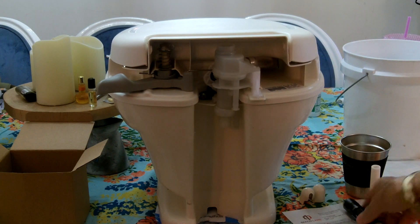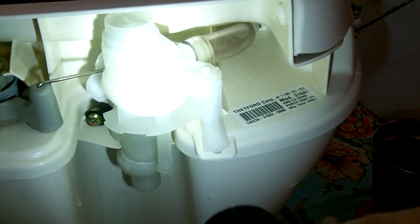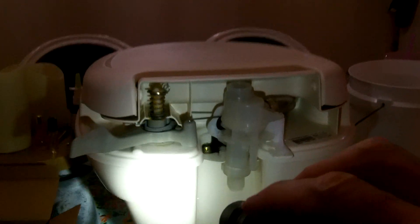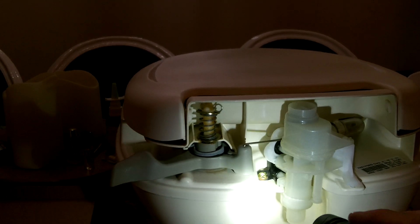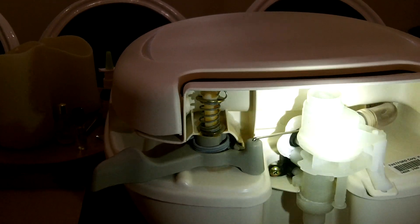I unclipped this and pulled off the plastic tube. I'll show you a close-up here under the light so you can see — there's a plastic tube in here that goes to the toilet where your fresh water comes in. There's a little nip right here that you pry off; there's a little channel it slides into. Then that little metal bar goes from the piece that comes with it and you put it in the flusher arm. When you go to flush, it pulls that piece and opens the valve. There's one set screw — that gold or silver screw — you set that in and it's installed, and it comes out the same way.